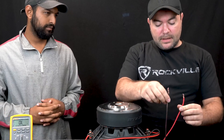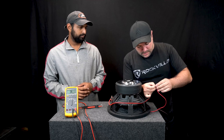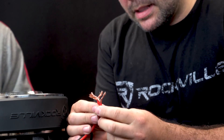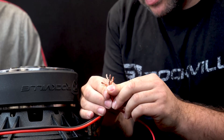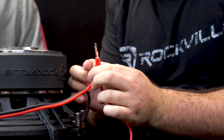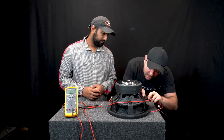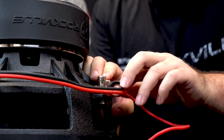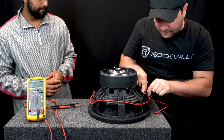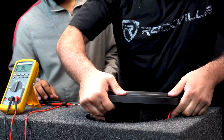I'll show you how to wire it into the enclosure box directly. You've got a positive and negative wire connected inside the box to the terminals. I'm going to split the wire strands on both sides and then use my fingers to do a nice tight twist, leaving one intertwined wire. Put that into the positive terminal nicely — you don't want too many strands sticking out, because you don't want the positive wire to touch the negative, so do be careful.